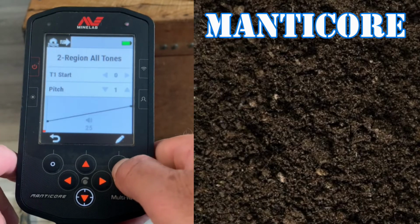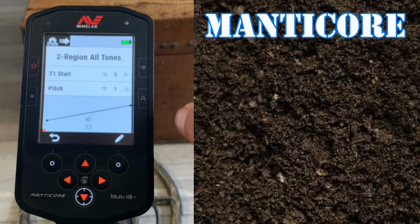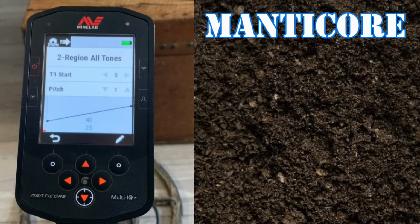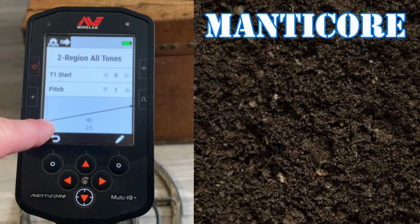But what I would suggest, you can use it however you want, but like I showed at the start of the video, if you've got your sensitivity slightly too high, you're going to get a lot of ones and twos falsing, keep coming through. If you haven't got your pitch changed and you've got it up there, it's just going to sound like a good target constantly coming through on the ones and twos.